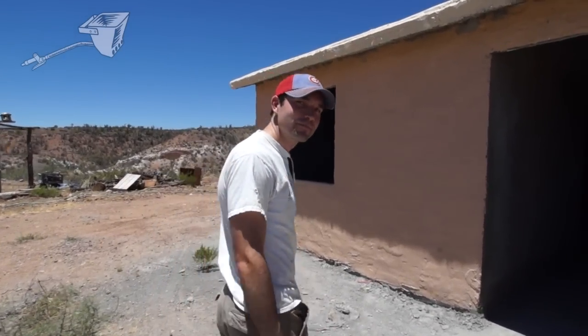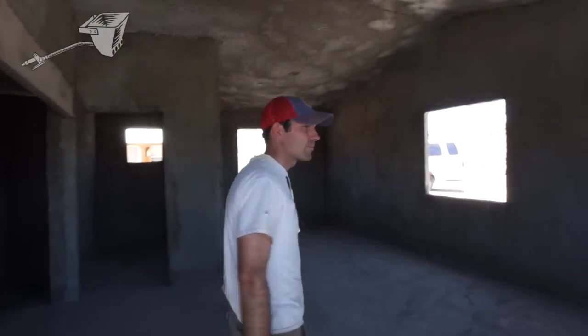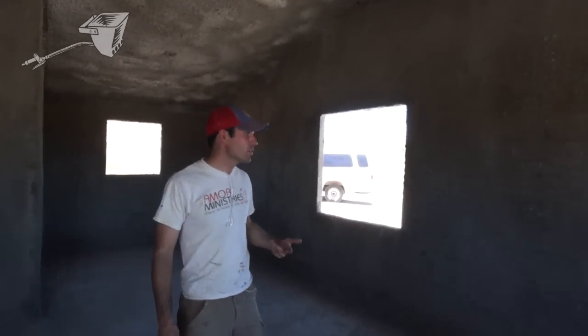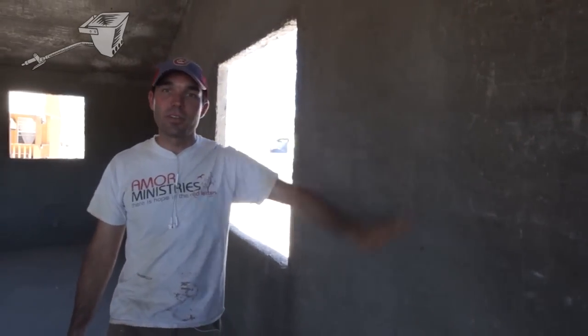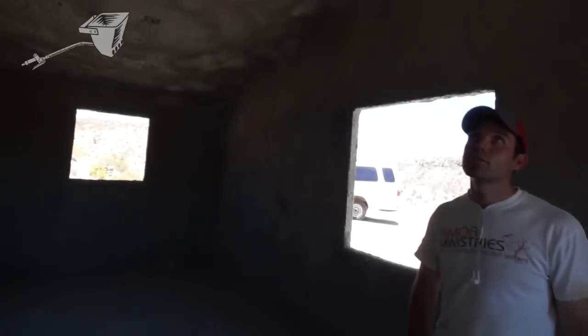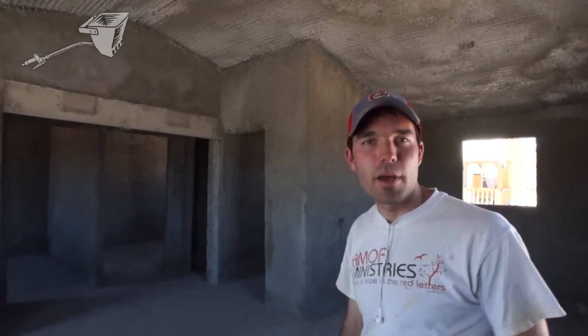We've arrived at another house in San Carlos. This is Stacy Jose's house, and this is kind of a middle point in the home building process. The interior walls have two coats of nice smooth stucco. Most recently we've been working on the ceiling, using the mortar sprayer to shoot stucco onto it. In this particular room it's had two coats.